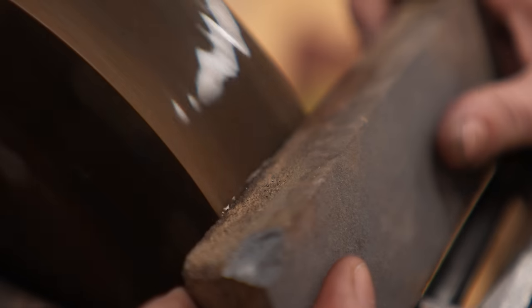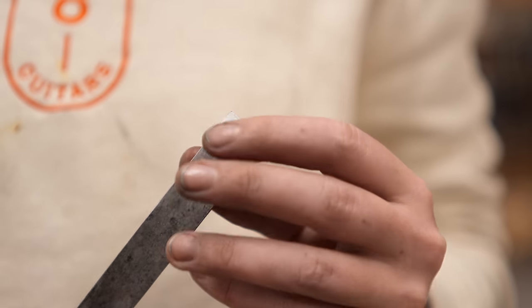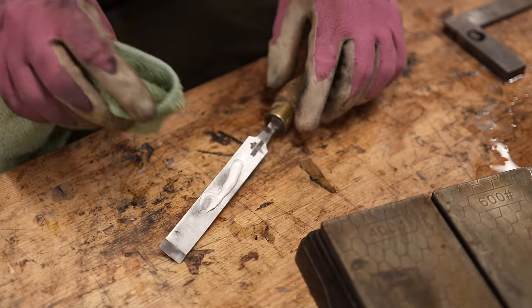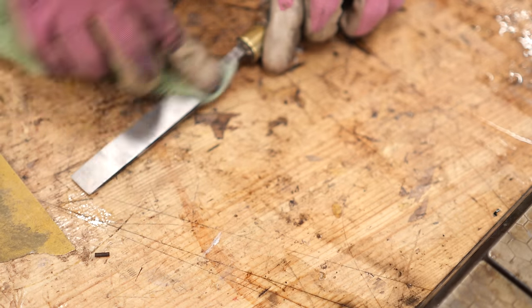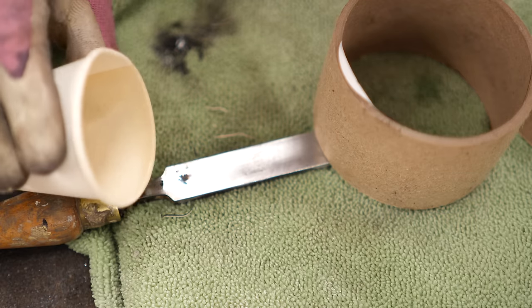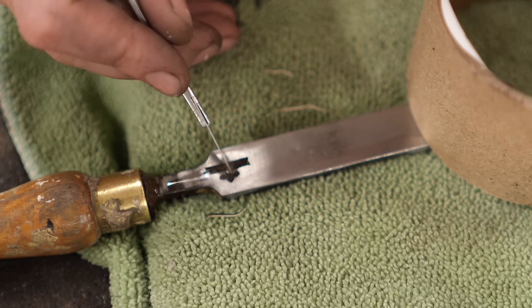My wheel got a bit old, so I'm just re-honing that with a stone to make it nice and efficient. That didn't really take me too long at all once I had a freshly ground stone. So now I'm just going to flatten that back up without removing any unnecessary waste, and get on to polishing it up. One thing that was quite an easy fix was just cleaning out the maker's mark on the steel. The way I did that was to get the initial stuff out with a scalpel and then pour in some thinners — the same kind I use for cleaning my spray guns, so just standard thinners. That made a world of difference once I left it on there for a bit.